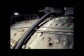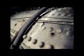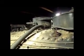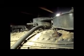But what happens is that stuff keeps suspended in there and eventually drops in. And when it drops to the bottom of the boiler, you need to get rid of it. So you blow it down, which releases the amount of water in there. And it would either shoot out the side, which it used to do, or it would come up this pipe here and out this muffler system, which spins out the sediments in the top here and lets the steam escape. So that's what blowdown does. It's basically cleaning out the bottom of the boiler by releasing steam pressure from the very bottom.